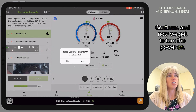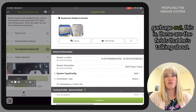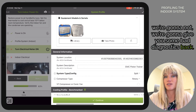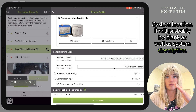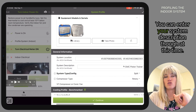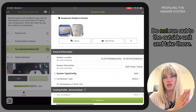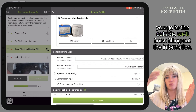Hit Continue and now we get to turn the power on and profile the indoor system. If you've ever heard about 'garbage in, garbage out' — these are the fields being referenced, because if we don't have good data or your refrigerant isn't right, we're going to give you bad diagnostics back. If this is your first time at this site, the location field and system description will probably be blank. Don't worry about the location being blank — that will be taken care of further down the workflow. A lot of the fields you'll see are for the outside, so don't run out to the outside unit just yet.